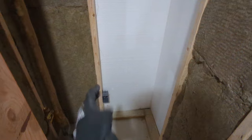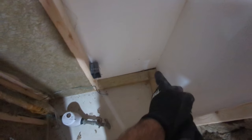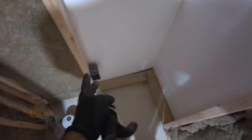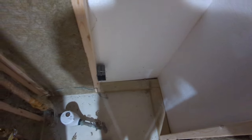Switch on and off for the light in this room. And at least one outlet. I think that combi unit plugs in with the lamp cord. I'm going to do these lower down. The water's on this side, and you really aren't going to want to kick through anything on either wall here. I'd probably stay away from the water if I can help it. And we'll unlikely be in the corner right there. There'll be a stick here. So I think, if anything, we'll switch to a dual gang box there just to get four outlets in here. You never know what you want to plug in here if you're doing a little service and you've got a couple of tools that you want to plug right in.